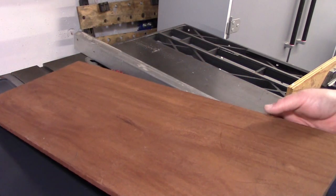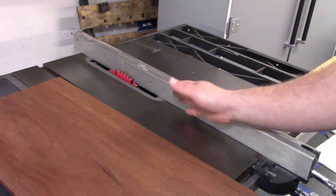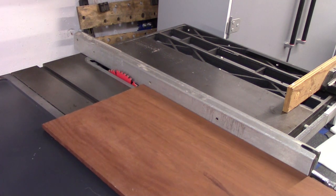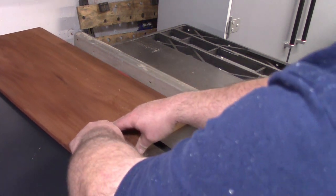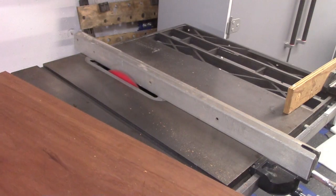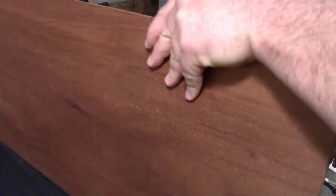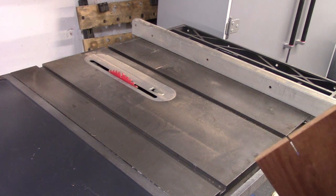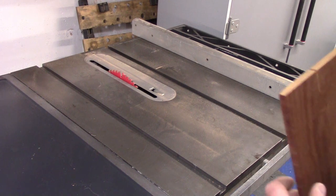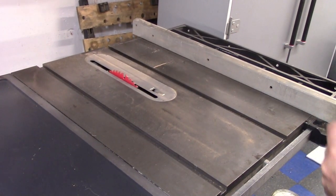For the front panel, we're using this piece of mahogany that was generously given to me by a friend. It has rough-cut outside edges, so what we're going to do right now is cut one edge off — that's going to be our true side to take our measurement from. We got a nice straight edge, and we'll use that up against the fence to make our measure cut. We want about ten and a half inches, set a little below that to make a nice gap so it can sit in. Let's run it through.